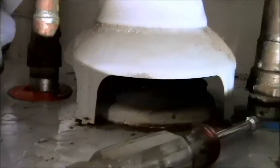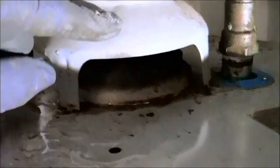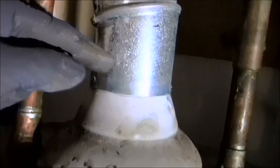That's all I've done, is cut those, and then I started to back out these screws that go onto this vent. This part of the vent is just kind of popped in there with a couple of ends of the metal into the water heater itself. But since the new water heater already has this installed on it, I'm not going to worry about taking that out. I'm more worried about getting this flexed over enough, so I'll probably end up taking that part out just so that it's out of my way, because I don't know how I'm going to fashion it back. But yeah, take out these, and then I'm going to take out these at the top, and that'll get rid of this.